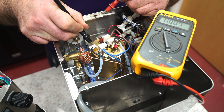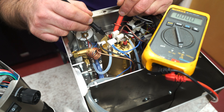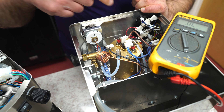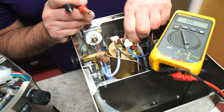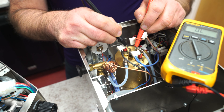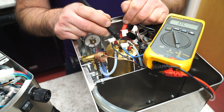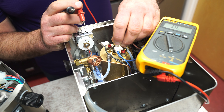If you see the ceramic here — if that's cracked, or if the insulation down in here is broken — you may get a reading from the terminal to the boiler wall. So that's for the heating element. You could do the same thing for switches. Here's the safety thermostat. Sometimes a safety thermostat takes a hit from a surge from the power company when they're switching power on their power plants. So we go from here to here — we're good. If we're not good, press the push button; if you hear a click, that should reset it. However, if it keeps on clicking, it could mean that your boiler is overheating because it has power and a short to ground, which will overheat. So if this keeps on clicking, there may be an issue with the thermostat or with the heating element.